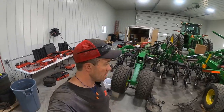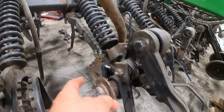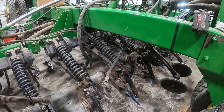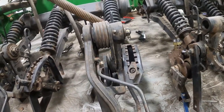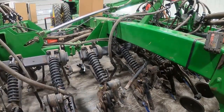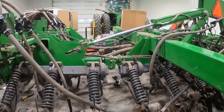It's about 5:30. We had a little slow going but moved along pretty well. All seed boots are on, stabilizers are on, seed tabs are on and ready to go. Chadron has been working through making sure the press wheels and closing wheels are tight, and we'll grease those soon. A little bit more to go pushing out a few bushings and installing some greaseless bushings. We are in a good spot and should be able to finish up tomorrow pretty easily.